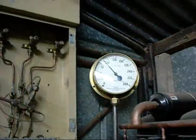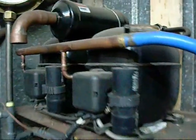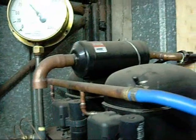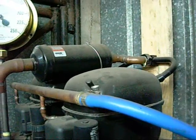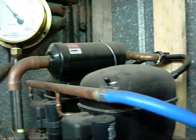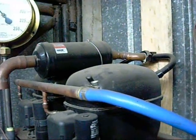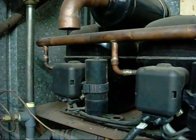Right now it's holding about 90 to 95 pounds. Basically all I have to do for this tandem unit is construct a filter. In this case I used a filter dryer canister. You don't have to use a filter dryer — the dryer element will pack up with moisture before a couple of days anyway, it won't take long. But the filter aspect of it does its job. You could use a regular air filter or an automotive air cleaner or something like that.